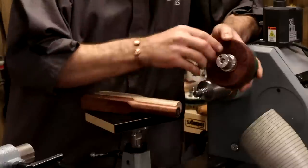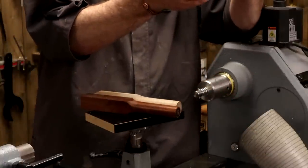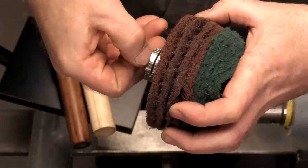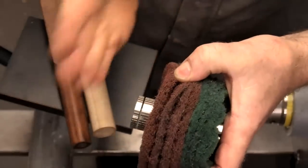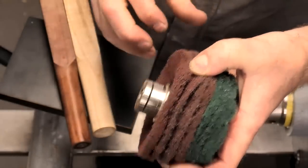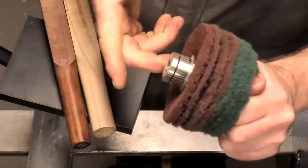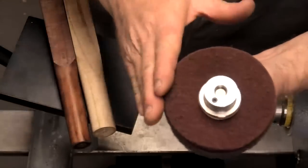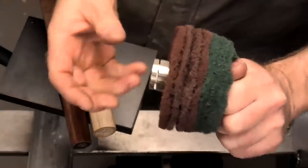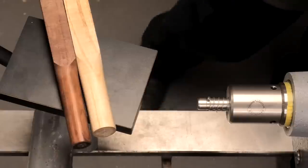I'm just trying to see if we can see it on the camera. Camera three, the overhead will be better, look. Right. Can you see that slot now, look? So this grub screw comes through from there, pushes on the side of that plate, pushes it up at a very slight angle. So actually it now means this won't undo. That's going to become a little bit important later on. So that little side grub screw forces on the side, wedges it over a little bit. So that actually locks it in, okay? So quite an important little one for what we're going to use it for a bit later, okay? I understand where you're heading now, okay?